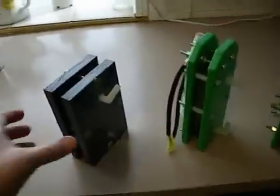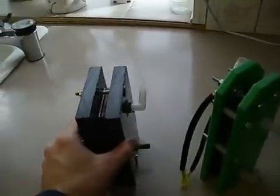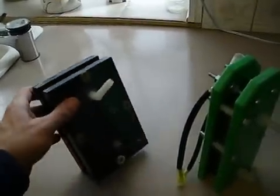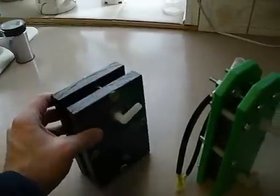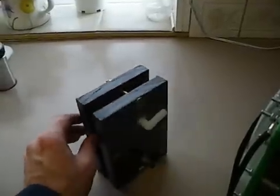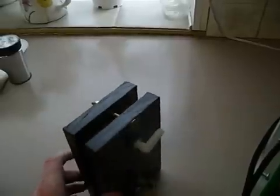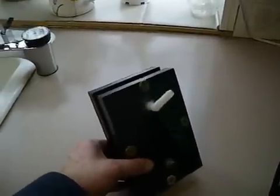The first one was this one. This is a little four plate generator — just four plates. The plates are 2 and a half inches by 5 inches. A little dry cell. I put this together myself just to make an installation video one day. This one produced 1.2 liters a minute at 20 amps bubbling the gas through 68 degree water. Not too bad, not too great, but for a one hour project, throwing this together wasn't too bad.